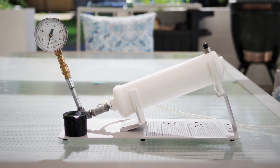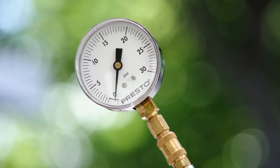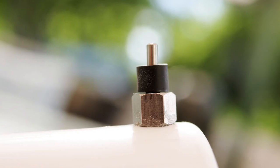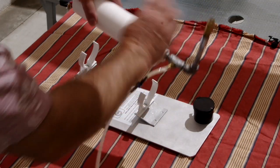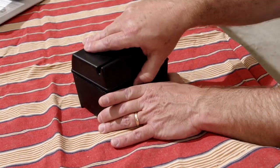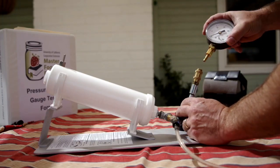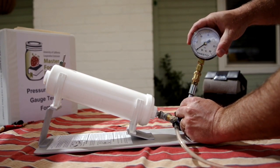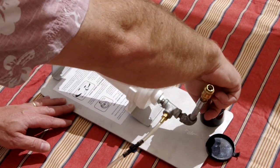Gauge testing works by comparing a client's gauge readings to a calibrated master gauge. This is the assembled testing unit. It has a foot pump to pressurize the apparatus, attached to a plastic cylinder with a master gauge on one end and a vent pipe with a rubber adapter seal on the other. Your unit may need some simple assembly. Insert the cylinder with the brass connector on the lower end, remove the master gauge from its case and insert it by pressing onto the brass connector. Make sure it is securely attached. Finally, slide a rubber seal on the vent pipe.